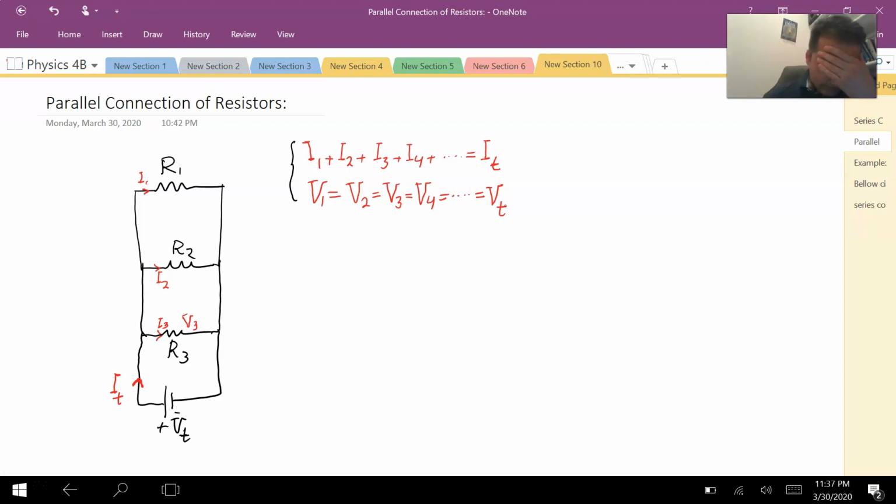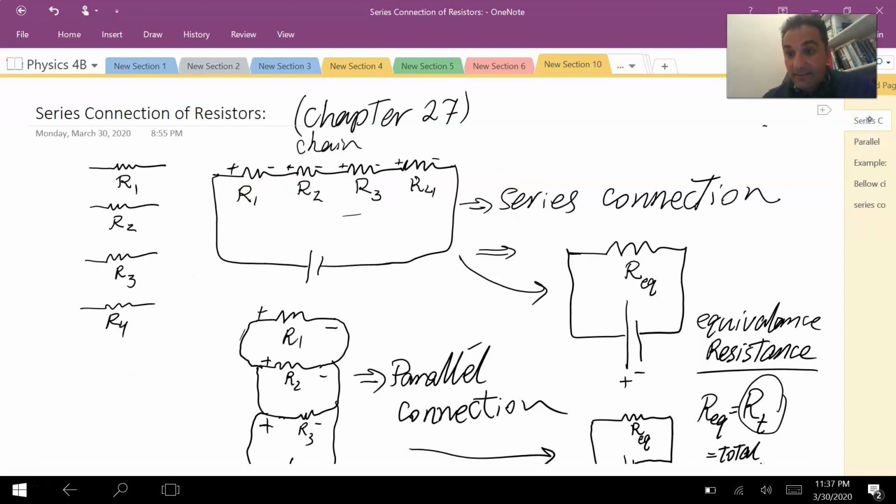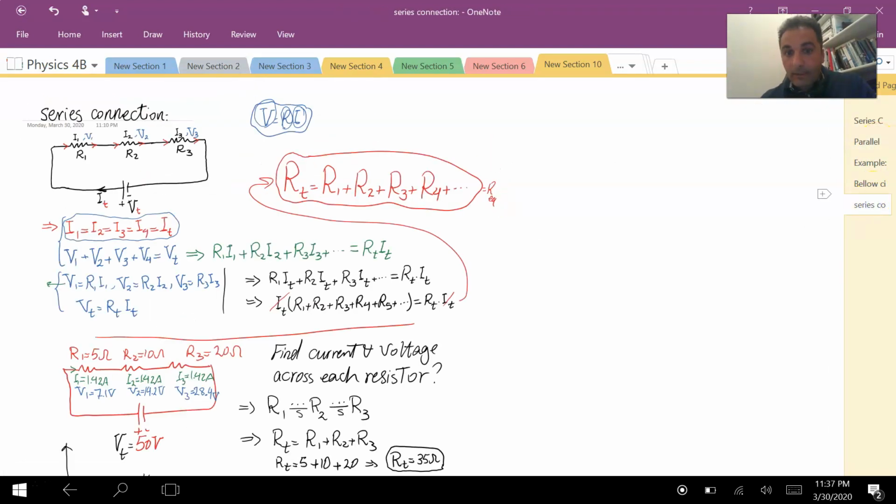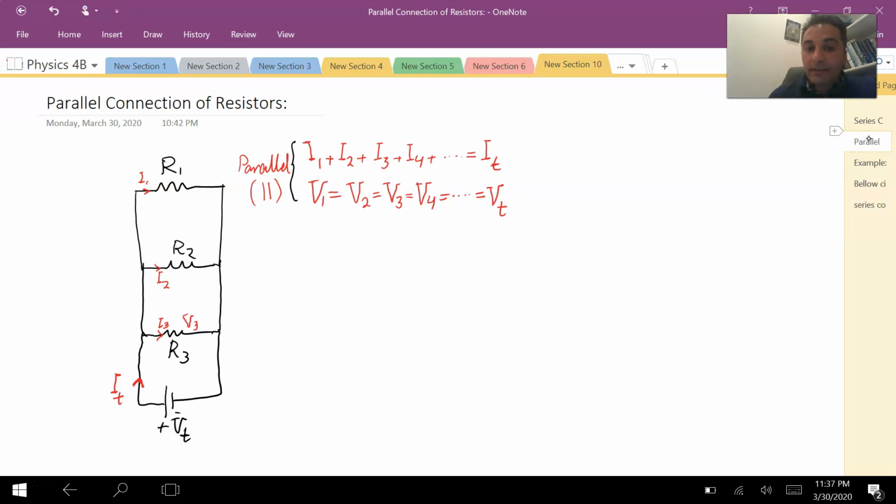Now, look guys, so when they are parallel, this is the parallel symbol, you know, just two parallel lines. When they are parallel, ask this question. What is equal? Our voltage. When they are series connection, what is equal? Currents. When they are parallel, what is equal? Voltage. When they are series, what is equal? Currents. When they are parallel, what is equal? Voltage. Okay,